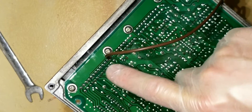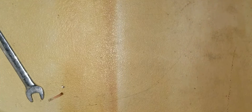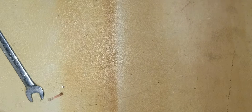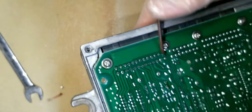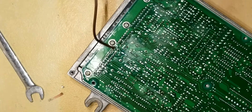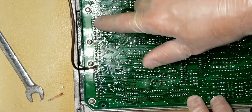You've got plug A, B, and D. So plug A, top row, last one from the left on the left side — that should be ground. Let me make sure I didn't mess up on that. Yeah, one should be power. So the top one is ground. We'll test this theory later. And then we're going to put a power lead on there and a signal lead on this side.